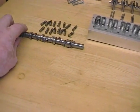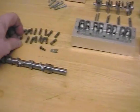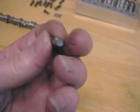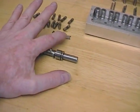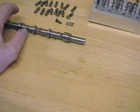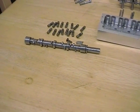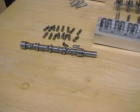Totally stripped down now. This is the camshaft. These are the cam followers — made these out of stainless steel, drilled them and hardened them. That's the keep for the camshaft, which locks it into position. I may make a camshaft grinder which works on a similar principle to how the crankshaft grinder does, but that camshaft is adequate to get the engine running so I may not bother at the end of the day.